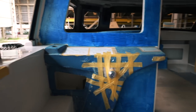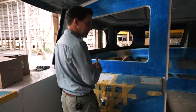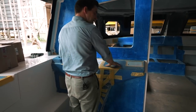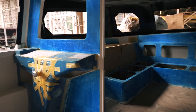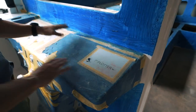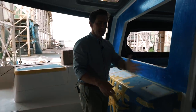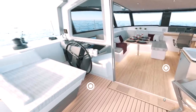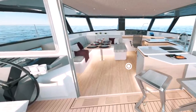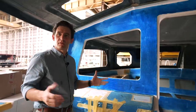The helms are now in, covered in blue protective wrap - they'll be done in gray, the same gray as the roof. We look at all the ergonomics on our other boats and transfer what works. With a one-meter wheel you're using your arms over the top - we've got a much larger helm layout than on our other boats. We've just got a standard seven-inch plotter here as a trial - final locations aren't set yet. We're going to slide this over and put light switches here, accessible from non-skipper crew. We've got space for 12-inch screens, electric anchor winch control, and all engine controls.